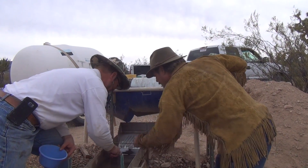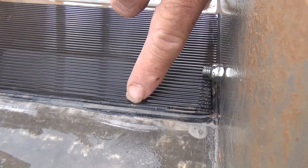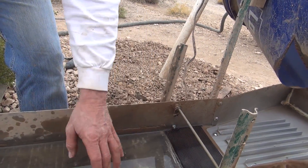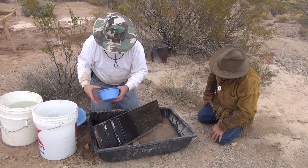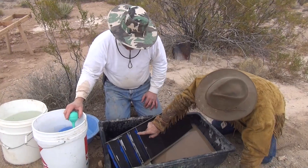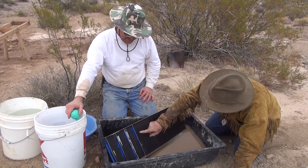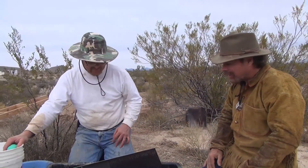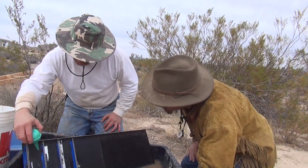We're working on some other designs to help improve this. I see little specks right there — we're seeing a few. You can see it plain as day, right there. It naturally drops into that low pressure zone. The finer stuff is picked up here and of course the bigger pieces will be in the vortex. So really only the minus-200 material gets down onto the clean gold section. I can see gold in there. That's what I like about this vortex matting — it just really grabs hold of it.